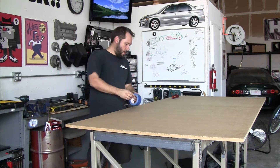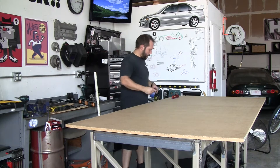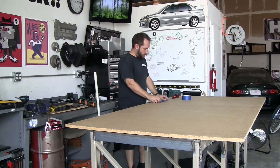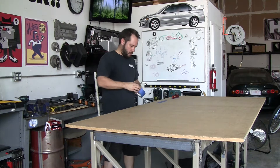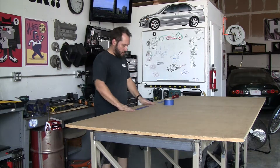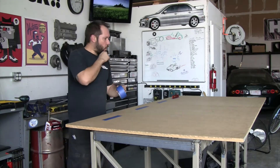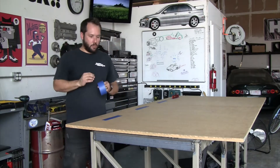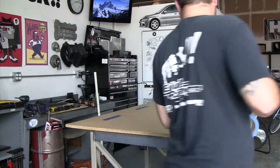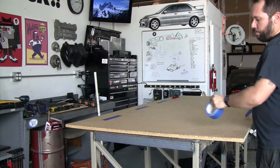The first thing I want to do to start getting an idea of what the table looks like is lay some tape at some strategic spots, then measure the level of those spots and start moving the legs around until each one is real close to level — as close as I can get. I saw this little trick on YouTube for leveling a pool table and figured it's pretty similar.